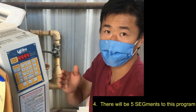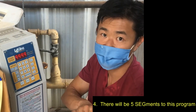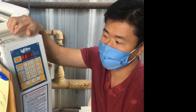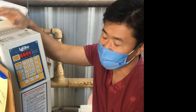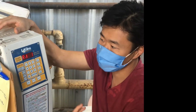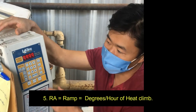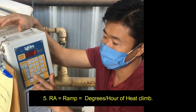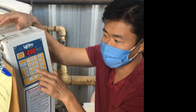Basically what I told it is that in this program I'm going to give it 5 steps. So now it's going to ask you: RA1 stands for Ramp 1. It means, okay, let's begin writing Step 1 — how fast do you want to go? Ramp stands for temperature per hour. So for Ramp 1, I'm going to tell it to go 200 degrees an hour. I'm going to press 200 and Enter.